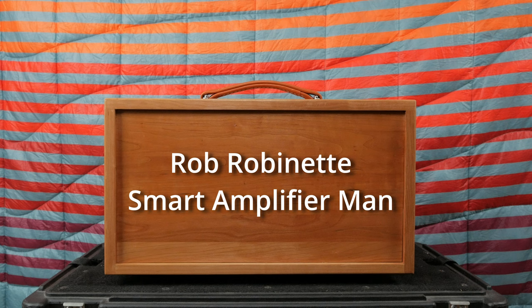It's not a huge effect, but the brightest setting on the tone control moves to less than max on the tone dial. This only occurs when the normal channel is in use. The bright channel does not suffer from this control quirk. It's another reason, besides the bright cap, the bright channel is brighter than the normal channel.